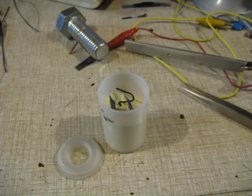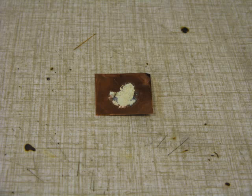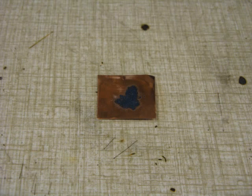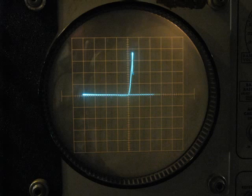Pieces of copper or lead that had been sitting in some powdered sulfur for a long time also acted as Memristors. Placing a small pile of powdered sulfur on a piece of copper sheet for just a few hours produced a black area that worked well as a Memristor when in contact with a piece of aluminum. This is the curved trace that it produced.